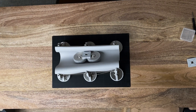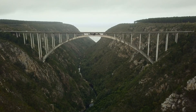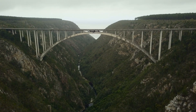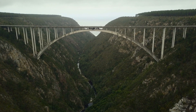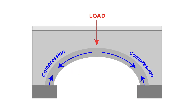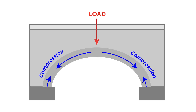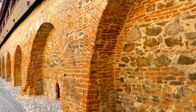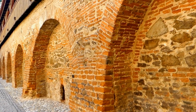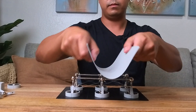How does the arch work so it can take on more load? Arches are curved structures that support loads by distributing weight and force in a way that makes them rigid and strong. The arch is a strong structural shape because it distributes forces equally along the curve, compressing the curve. Paper and common construction materials such as concrete and brick are strongest when you load them in compression versus when you try bending or flexing them in the middle. That's why arches are so strong and widely used.